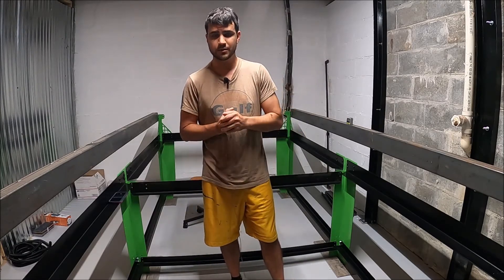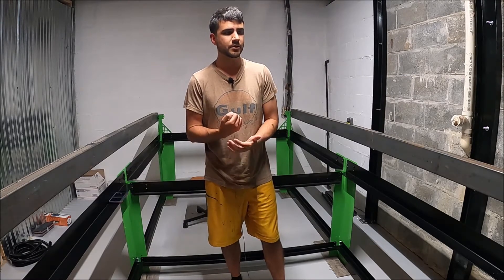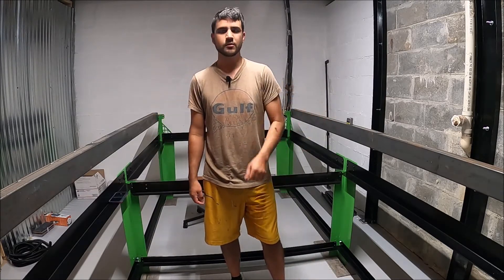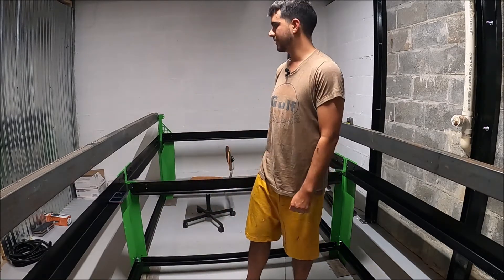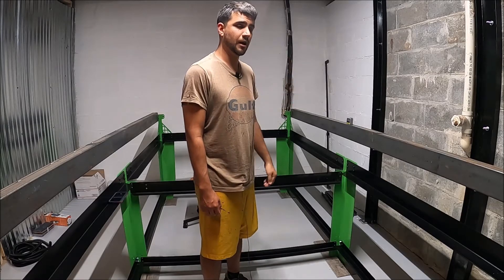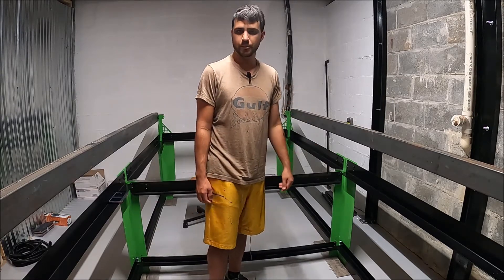Sounds really good in my head — I don't know what kind of tolerances I'll be able to hold with that. Some other people on YouTube using the router attachment on their Premier Plasma table said they were having issues. With the plasma cutter head, whether or not it's in plane isn't that big of a deal — the tolerances on these holes and parts were pretty good. So it's not all loosey-goosey floppy. There's a little tweaking I might be able to do when setting up the table, but not a whole lot as tight as these bolts fit.